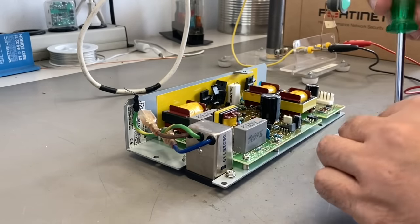Speaking of strange decisions — here are two power supplies from the same manufacturer. This time they have an aluminium heatsink, but they mounted the transistor upside down with the front face to the heatsink. So I assume not much cooling is needed for this one, but it's strange anyway.